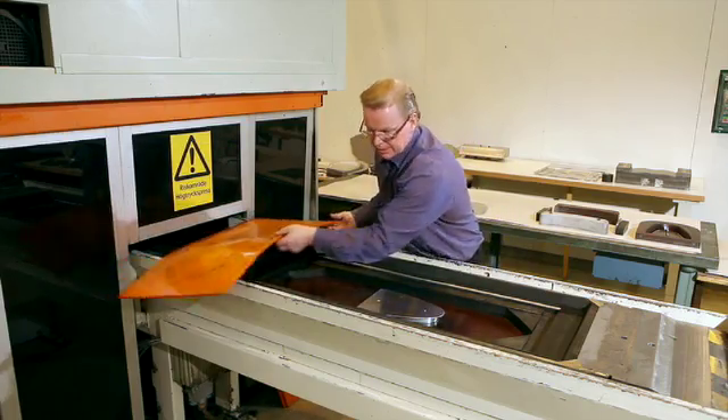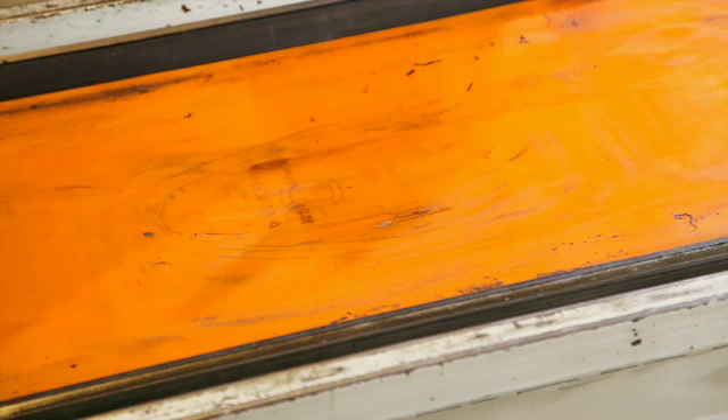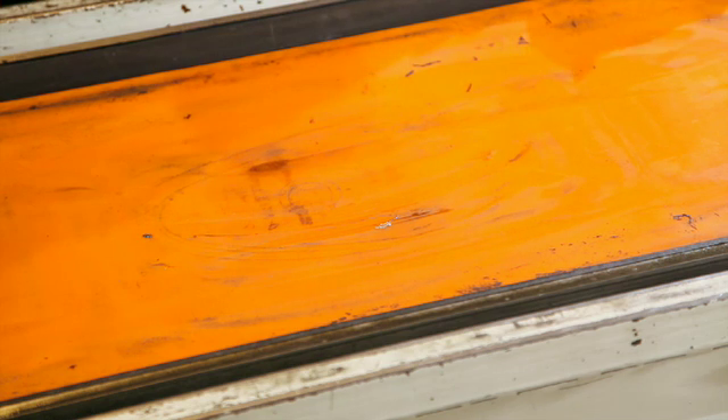In this case, I will just use one throw pad, because the tool height is not so high, so it's just enough with one throw pad on top of it. And then we start the press cycle. We are going to use 340 bars.